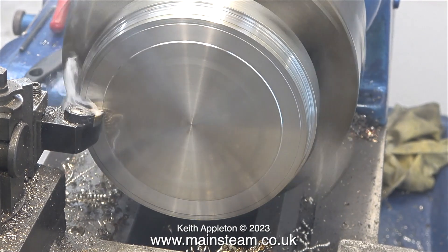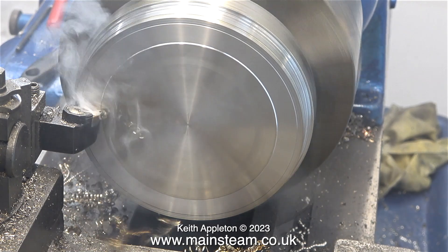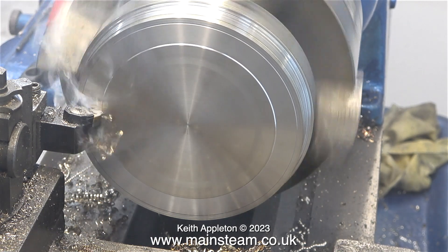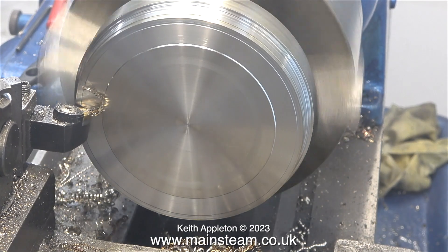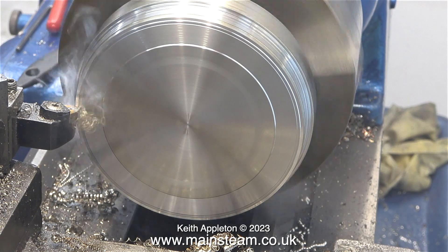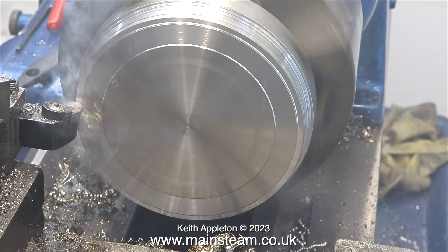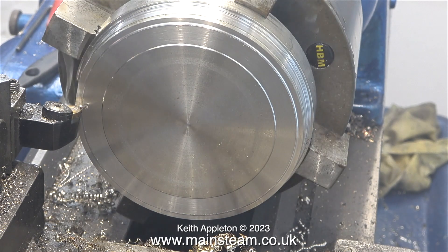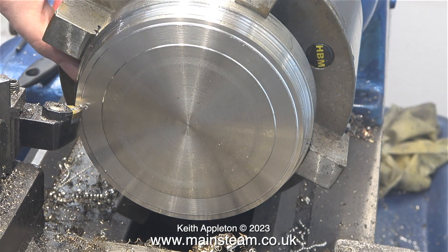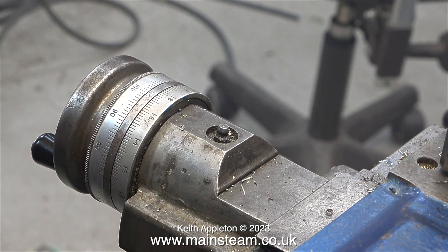In this next clip I'm facing across the front of the piece of metal — I really do need to make this a lot thinner. I only bought such a big piece for the video. Now I'm going to show you how to do the job wrong: with the lathe running at its slowest normal speed, without back gear engaged, the auto traverse feed is a little bit on the fast side and the whole thing grinds to a halt. During this mild lockup the lathe wasn't damaged and the cutting tool wasn't broken.